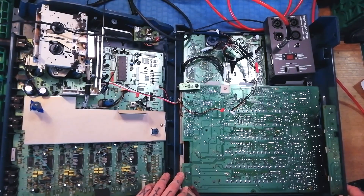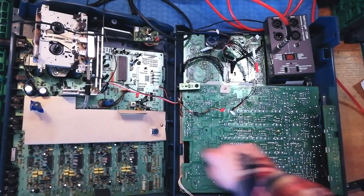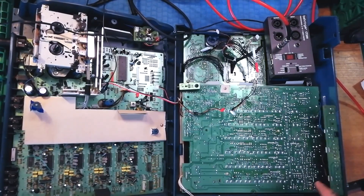The approach I'm taking is: I get a working channel and feed the signal through it. Without a schematic and without having removed the mixer from its plastic casing, I don't know exactly which solder tabs relate to which component. But because the controls are laid out in strips, the signal flow to an extent goes from up here down here. So I want to establish a clear signal point at the top, one at the bottom, then find somewhere about halfway in between — then keep halving down — so I've got a series of points going from the input down to the fader.